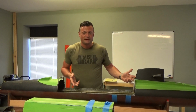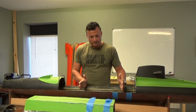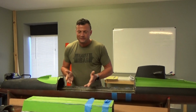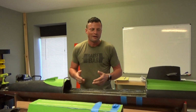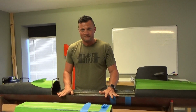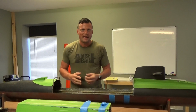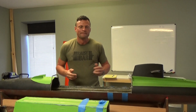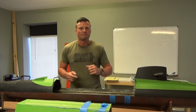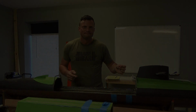You've got lots of opportunity for additional features if you wanted to. If you segregate the ballast tank a little forward, you could perhaps have some of the aft missile tubes fully functional. You've got lots of room for things to play with there. My advice to anybody though, especially if this is your first boat, walk then run. Get a functional boat in place. Allocate room for the toys, like video cameras, missiles, and torpedoes. After that is done, then start adding features slowly. Make sure that each one is functioning perfectly, and then you can add them as you go.